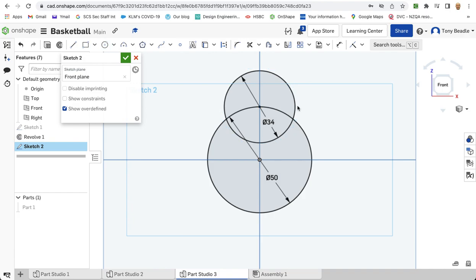We wanted another circle that's going to be 1.5mm wider than that. So we could start from the centre and drag that out and make it 35.5mm — that's one way to do it. Or the other way is to use the offset tool. Click on that circle and that will create a second circle. You can adjust it so we only want this to be 1.5mm distance.